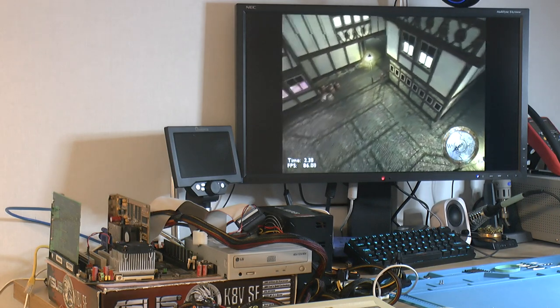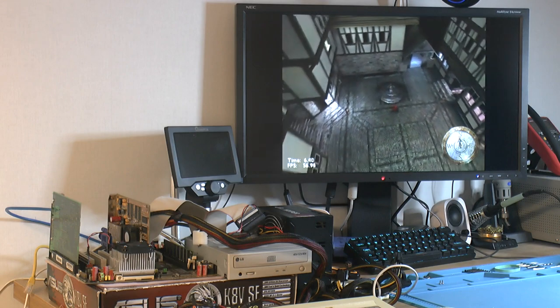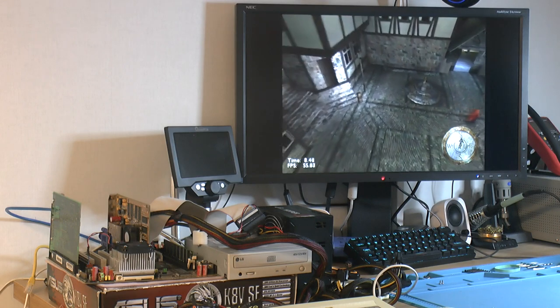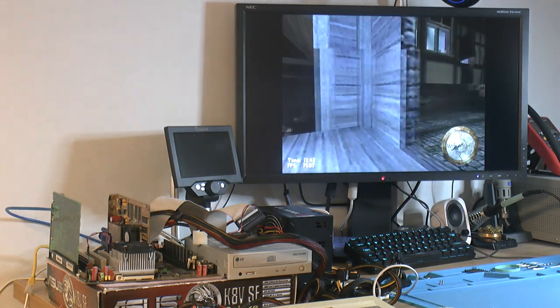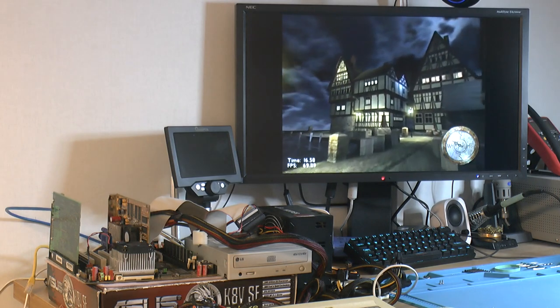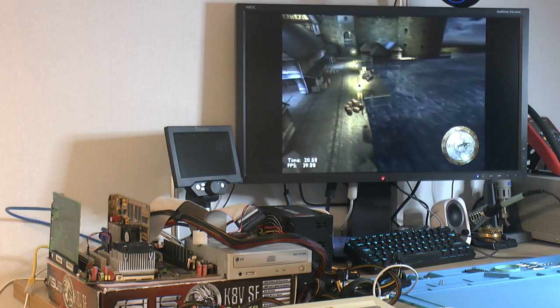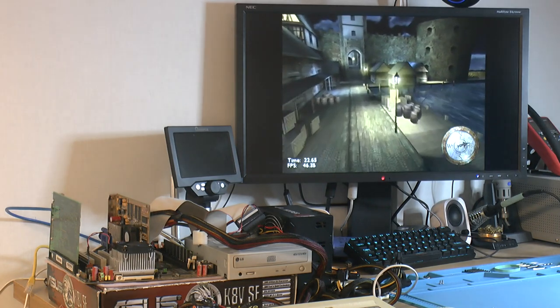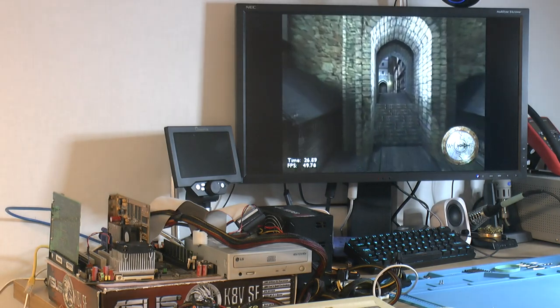Just to get a little bit higher score, around 2200 points now from just over 2000 on stock settings, which isn't great, not for that graphics card, but with a K6-2 450, you ain't getting much because the CPU doesn't have any on-die L2 cache. So with the K6-2 Plus or the K6-3 Plus, we should get a lot more. I think the world record is over 5,000 points.